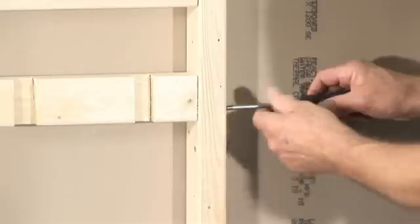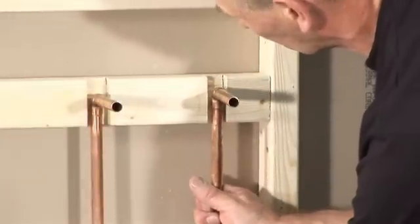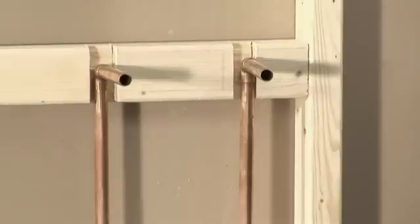If you're installing to a stud partition wall or similar, it's recommended that the brackets are secured to a wooden batten inside the wall. Complete the pipe work to the bracket mounting points, leaving around 60mm of pipe to protrude out of the wall. Flush the pipe work to clear the system of debris and check for leaks before making good the walls.